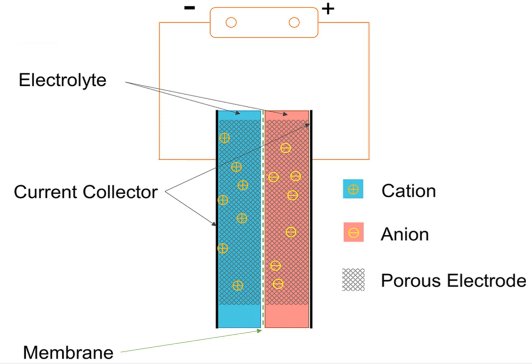The two-dimensional structure of graphene improves charging and discharging. Charge carriers in vertically oriented sheets can quickly migrate into or out of the deeper structures of the electrode, thus increasing currents. Such capacitors may be suitable for 100/120 Hz filter applications, which are unreachable for supercapacitors using other carbon materials.